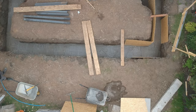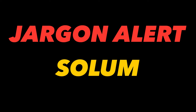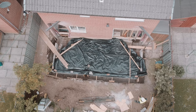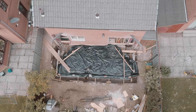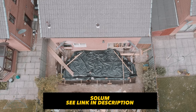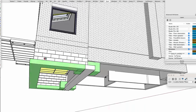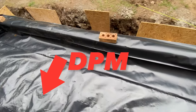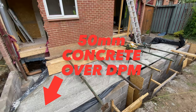Now it's time to seal the undercroft of the ground floor, or solum as it's called, and ensure it's properly treated from potential damp pathways into our new extension building — and let's not forget to ventilate it. I made a separate video about what a solum is and you can see that by clicking the link in the description below. We use a damp proof membrane and then pour a concrete mix onto it, usually 50 millimeters thick, to form a sealed base.